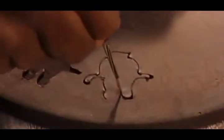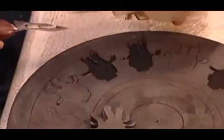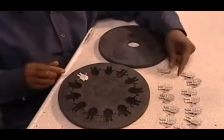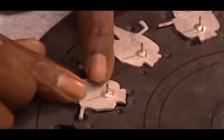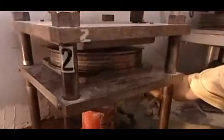It takes five minutes to dry. Then they cast enough copies of the master to fill up a rubber disc. After tracing the outlines, a worker uses a surgical knife to meticulously carve out the cavities. He softens the rubber with paint thinner to enable precision cuts, then places a copy of the master in each cavity. Another disc goes on top, then it's into a machine called a vulcanizer for one hour.